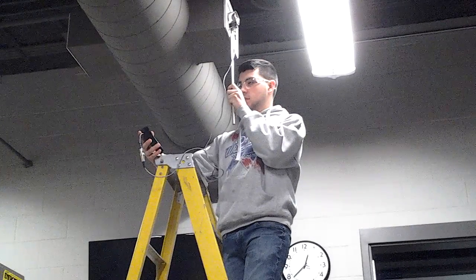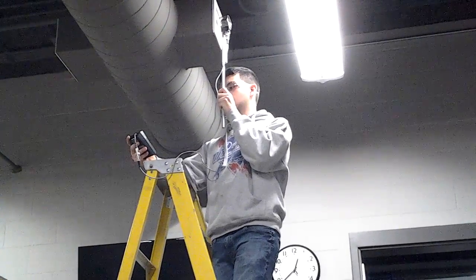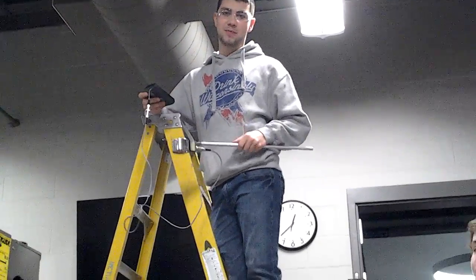What this one's reading right now is in feet per minute, and it's going to be — 288 is what it actually is. You're going to take the average of those 6, and that's how you use the model DA4000 digital anemometer.